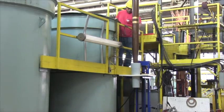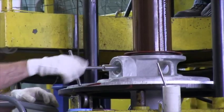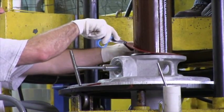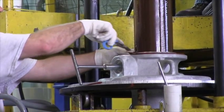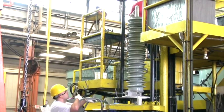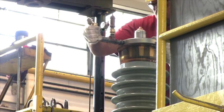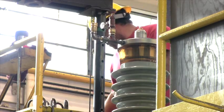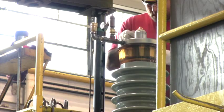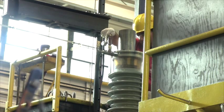The last major step in bushing manufacturing is the actual bushing assembly. To this point, this manufacturing overview has dealt entirely with the core of the bushing. It is at bushing assembly that these cores are assembled into the completed bushing. One of the final steps of bushing assembly is to place a compression load on the bushing. After all parts have been assembled and aligned properly, the assembler will apply the load and tighten down the bushing. This compression force serves to maintain the bushing seal integrity, as well as increase mechanical strength.